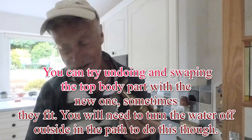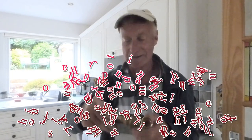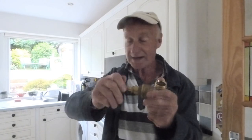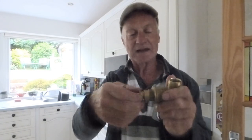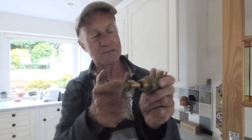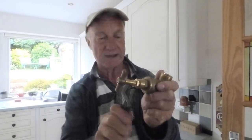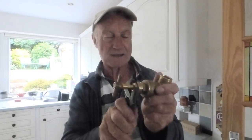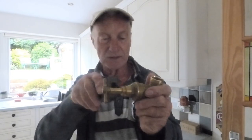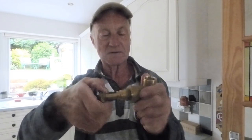At the end of the day, if you break it, it's already broken — so you're going to have to renew it anyway. But that's usually my remedy. You can then turn it back on, and usually once you've done that you can do it by hand. If you get any weeps out of this gland nut here, you can pack it with PTFE tape and push it in, then do it up again. Normally you can just tighten it up, but don't go too mad with this — if you tighten it too much you won't be able to turn it again, it'll go very stiff. There's a fine balance: ease it off a bit if it feels too tight and it will be nice and easy. Don't over-tighten this packing gland or you're back to square one.